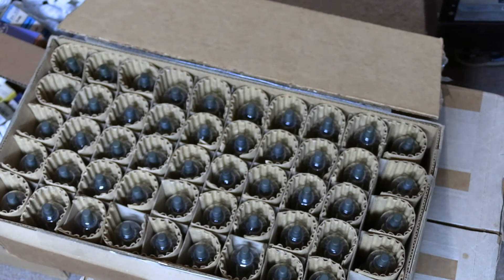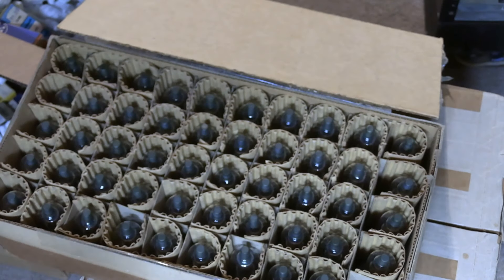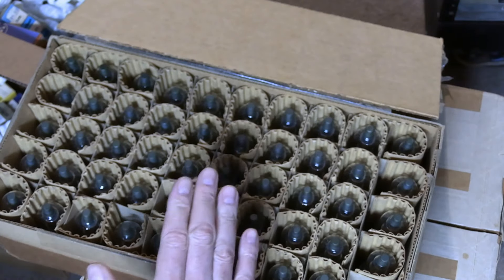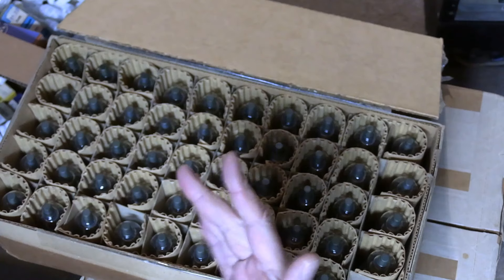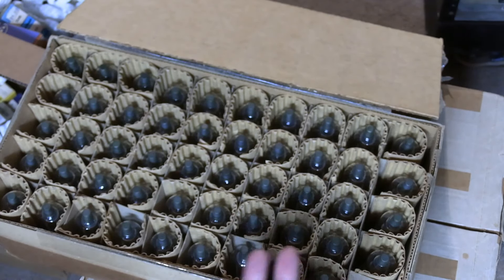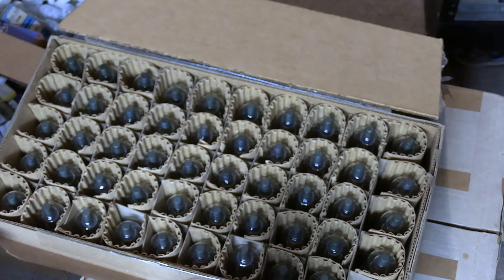I sure need a bunch because just about every set I've encountered lately they've been bad. Most of what I have on hand are used ones, and these are notoriously difficult to check. The tester will typically say it's good if it's 35 above — in other words, the emissions needle will be in the bad region, but when you look at the fine print in the tester there's a note saying they're still okay because these are meant to run with a plate voltage in the thousands of volts, and your tube tester is not putting anywhere near that much on it. So really the way to test them is to put them in a set. If it's a used one it might work, but you have no idea how much life it may have left. So I'd much rather go with new ones.